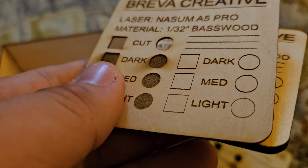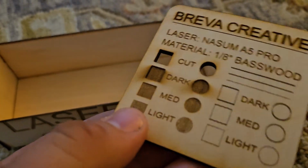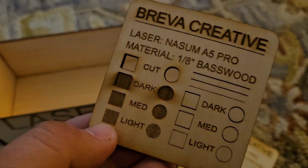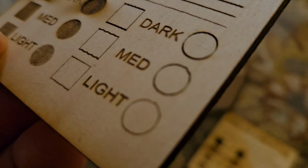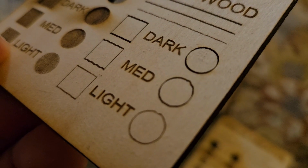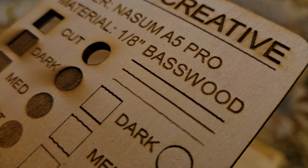The other thing I'm noticing is that in the X direction, the etch line is actually a little bit thicker than the Y-axis. Smarter people than I have told me that that's because the shape of a laser is actually not a perfect circle or a square. It's actually a rectangle, and nice lasers have optical corrective dongles that counteract that. Cheaper lasers don't.